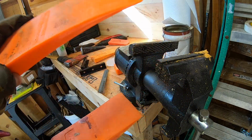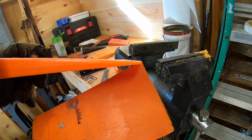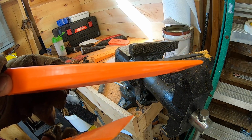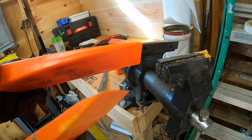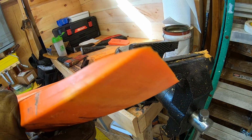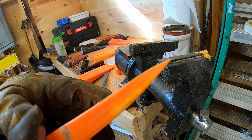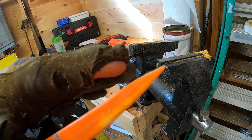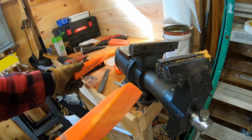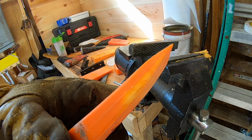I always keep one, I call this my starter wedge. This one's got obviously a real sharp tip. This one's a little bit more blunt. But if I pound this wedge into the tree first, open up that back cut a little bit, then I can pound Bertha here in, Big Bertha here, and that'll help me knock the tree over. So yeah, better than throwing it out, just reprofile it a little bit. Doesn't hurt. You can work it more, however, depends, whatever you're comfortable with. Obviously, this will work. This is our starter wedge, but this can be our chaser wedge, I call it, the second wedge we put in the tree.